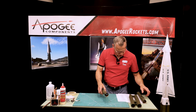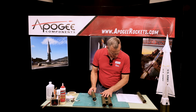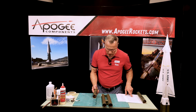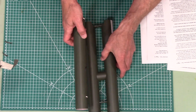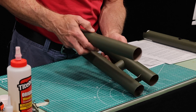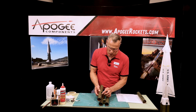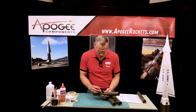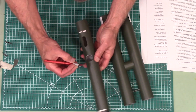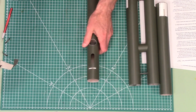Step 22 is to use wood glue, and we're going to glue these to this piece right here. If you want, it says that you can put glue around this hole here because that goes around that cross piece — that adds a little bit more glue. If there's going to be glue on it, it really helps to scrape the paint off to get a better bonding on that piece.